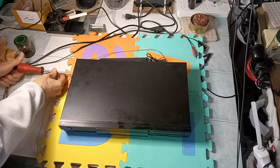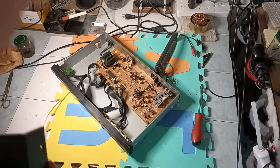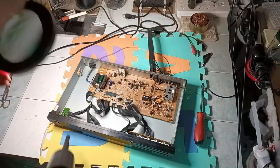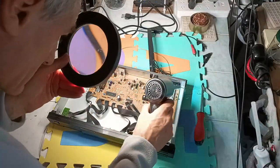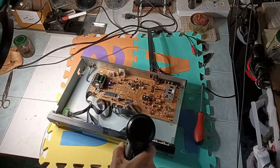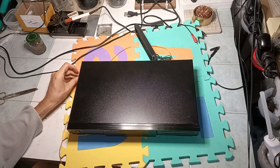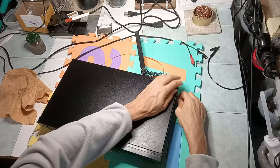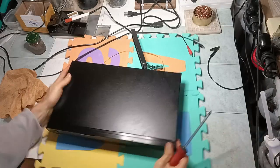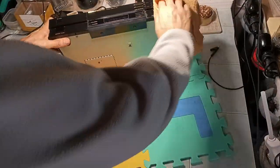Together with the amplifier, also the tuner ST35 came for cleaning and for an inspection. There is nothing remarkable to report about it, except that I find unwise the fact that the power cord does not include an external ground connection, while the internal power supply is not so well insulated against the metal cabinet. It is a pity that for such a beautiful and fairly expensive tuner, no shortwave band was designed.